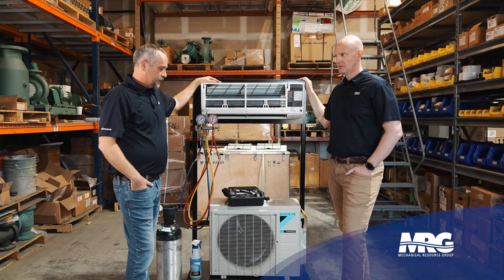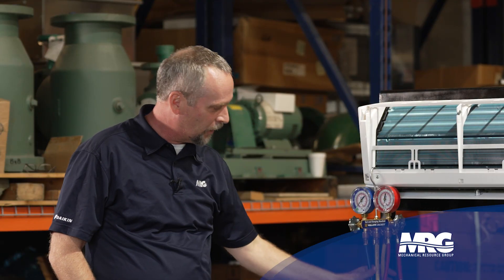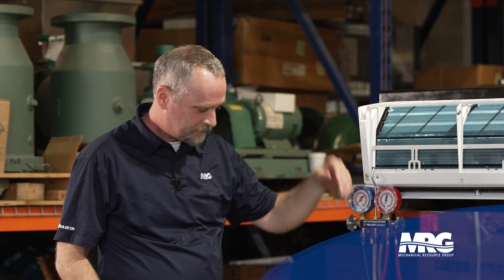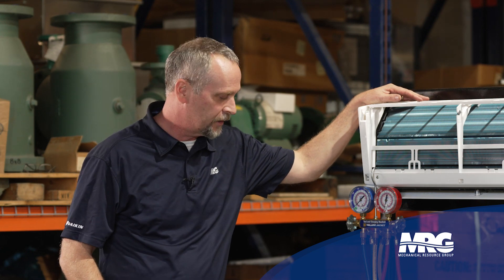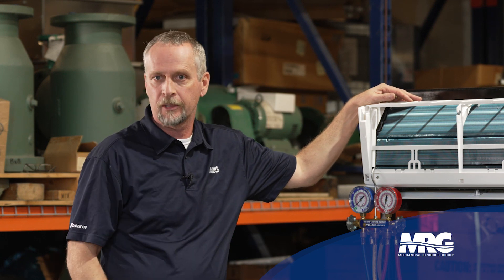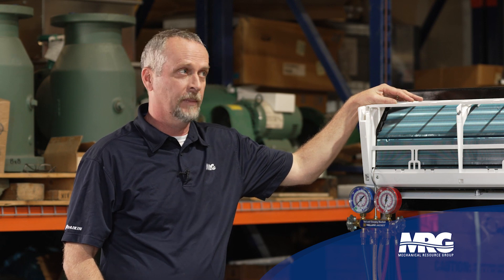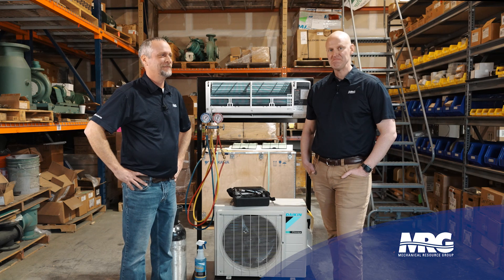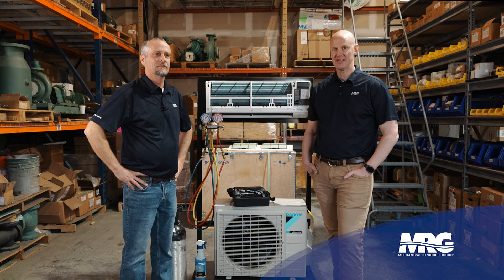Just make sure your tools are in good shape before you get started. Make sure all your hoses are good, no leaks, and all the rubber gaskets are good in them. Have a leak detector you're confident in and know works. The worst thing you can do is spend four hours chasing something around because your tool is not working. Make sure you've got good working equipment before you get started, and start A to Z and work your way back until you find it. Brian, always good to be with you. Hit that like, hit that subscribe, and come back and check us out again.